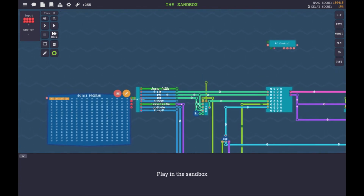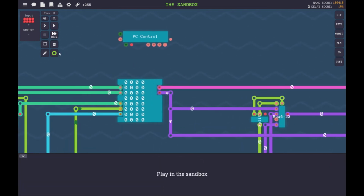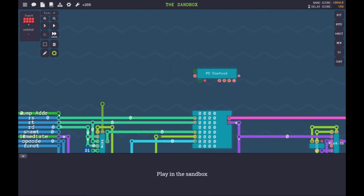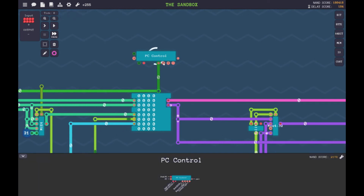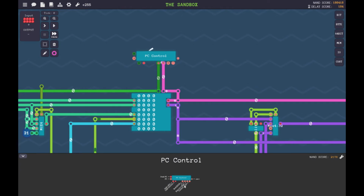Yeah, so the only thing that we have left to do in order to make a full machine is to implement the program counter and the control flow logic. So in the last video, we talked about the program counter control unit over here. And in this video, all we have to do is wire it up. So we can see over here, this leftmost pin wants the jump address. And so we can just bring the jump address over from the instruction unpack. The next pin over wants the A output of the register file, like so. And the next pin over wants something called the branch offset.